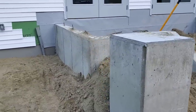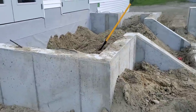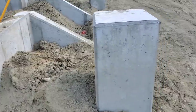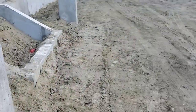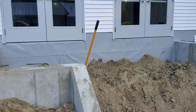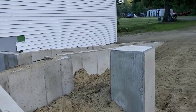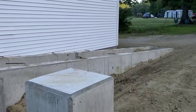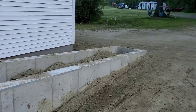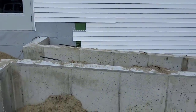Here's the set of stairs we got to set up. They got the frost walls all in — you can remember we showed you the footings before they poured the footing. Now they got the frost wall set on top of the footing. We got some piers here; that's where we're going to form up the set of stairs. We'll walk upstairs here onto a patio or platform and then into the building. Over here is where the wheelchair ramp is — 26 feet, pitched an inch per foot to make it to code.